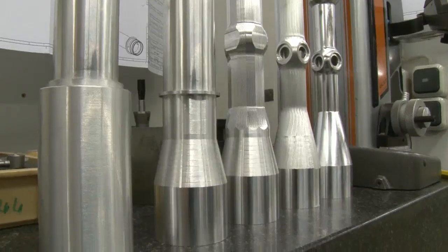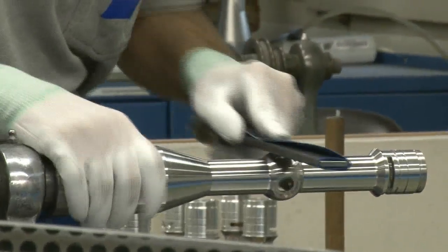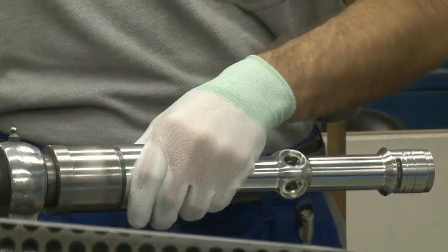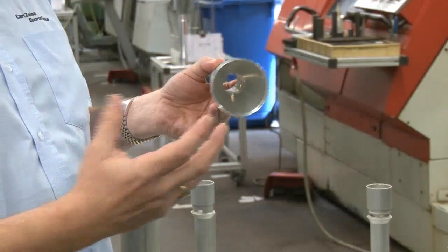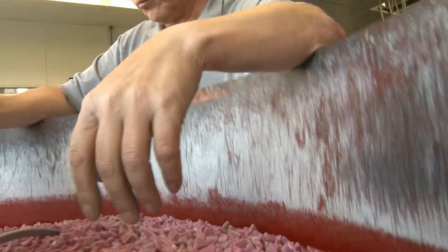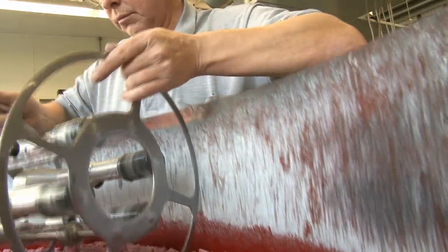The workman here does some manual burring just to remove the smaller particles. So there's a bit of machine milling and a bit of manual rubbing at this stage. From here it goes into a vat of ceramic marbles for even more burring, and then on to the next stage which involves glass pearl blasting.